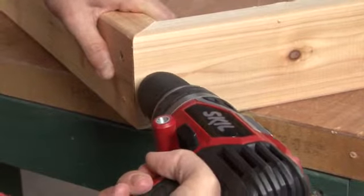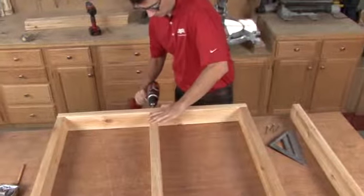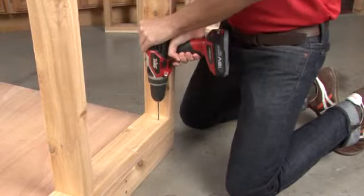So when should you take the extra step of drilling pilot holes? The answer is almost always. It's never a bad idea, as it will keep your screws straight and your wood in good condition. You'll also want to drill pilot holes any time you're working within two inches of the edge or the end of the wood. This is almost always the case with dimensional lumber. Always drill ahead of time when working with softer woods such as pine, fir, or cedar.